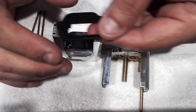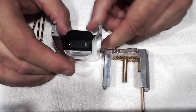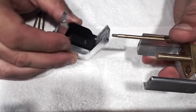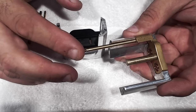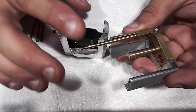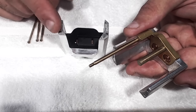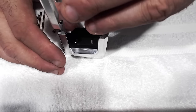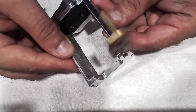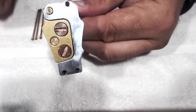Then this is our pre-cut Delrin, which holds this in place, so it fits perfectly in there. See that? Now this is where the power from our negative grounds will make connection. Basically, this brass rod is what connects the power of the negatives of the batteries through the CNC'd aluminum. So when I put this on here, I want to make sure I line up that hole first, to make sure that brass on the top is going to thread in the right way. So when I screw this in, I want to make sure that it screws in correctly.